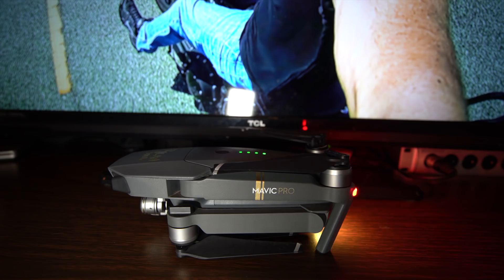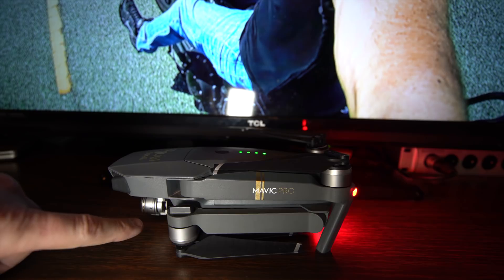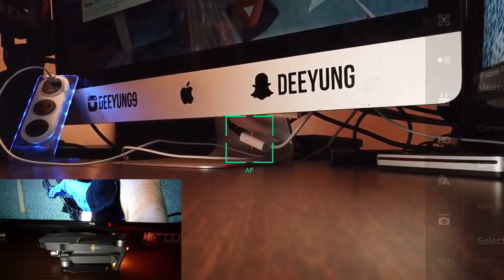Okay, now let's get into actually calibrating the IMU. As you can see, I have the DJI Mavic Pro sitting on a nice flat, level surface — level is very important. Notice that I have the arms folded up, and yes, that is correct; we do not want the arms unfolded. Also be sure to remove any gimbal clamp before you turn your drone on.